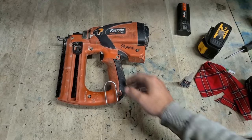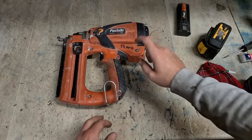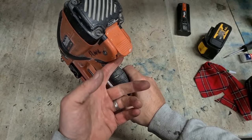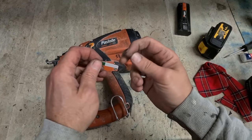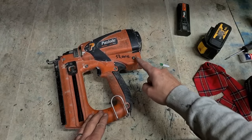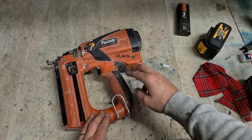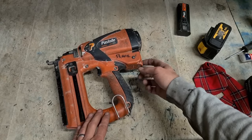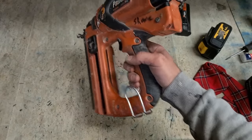That sorts it. Short term fix. It'll do for a little while. At least it leaves it so the fella knows where to put that bit of cardboard to fix it up. Can use a bit of plastic, but if you use anything too heavy, it's going to be too thick. Cut it to size, glue it on. That gives the extra bit of pressure to push against the gas. Short term fix, does for a while, but that's your only option. This door is just not available anymore. That'll keep this man running for a wee while.